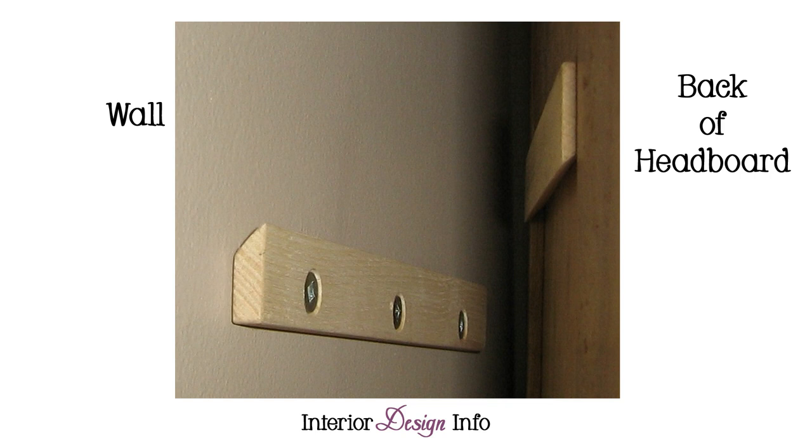The fourth way to hang heavy items on a wall is to use a French cleat. A French cleat is a horizontal fastener, typically between four inches and six foot long, that fits together like a long horizontal wedge shaped hook. One part is attached to the wall pointing upward and the other part is attached to the item to be hung, pointing downward. Once the heavy item is hung, the French cleat is often screwed together from the underside or the top. You can make your own French cleat out of wood or purchase one out of metal. French cleats are especially popular for hanging headboards on walls.